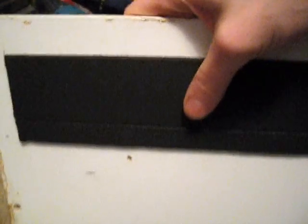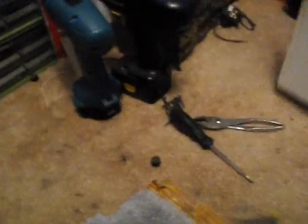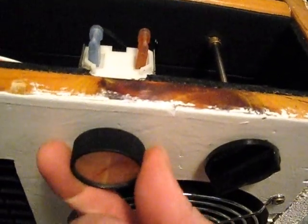Insulation tape — Armorflex — that's great stuff to use. You wrap that around anything and I love it. And here's the guts. That's obviously your master on/off switch, your thermostat so you set this for whatever temperature you want, and this here controls your evaporator fan speed.